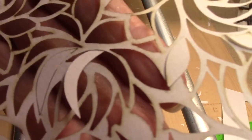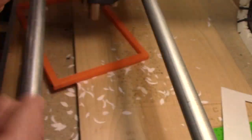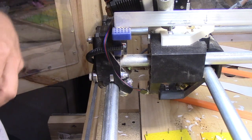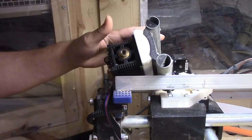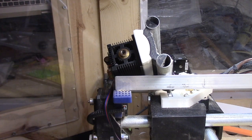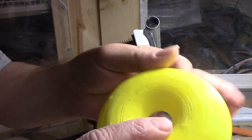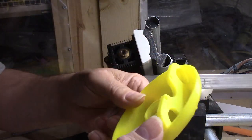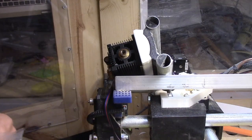So I initially just started by cutting this directly on the board, and if you can see carefully — the browning around the edges of the cuts on the back side — that's what we're trying to avoid. Before trying it a second time, I've got a few modifications to make. You can see I've got the laser head and Z-axis off here. The wind blowing down out of the laser module tends to scatter all those bits and pieces around the area, and I'd like to just have them fall down. What I've designed is something to redirect the wind. The advantage of the wind is it certainly puts out any fires that might be starting; the bad thing is it blows parts around and lifts the piece of paper off the focal plane.